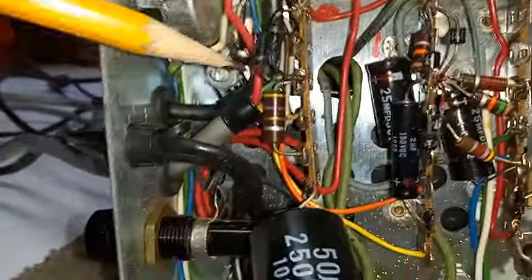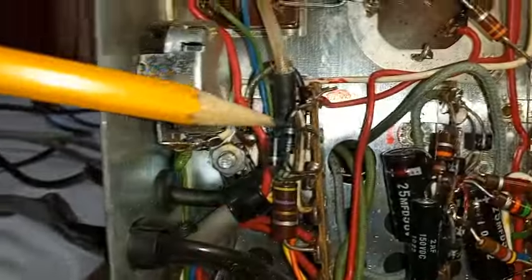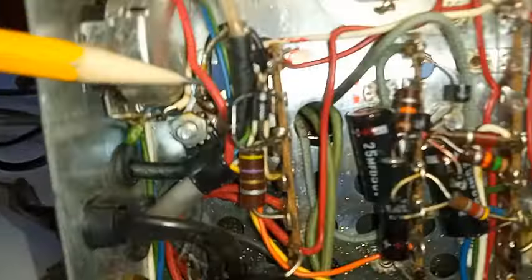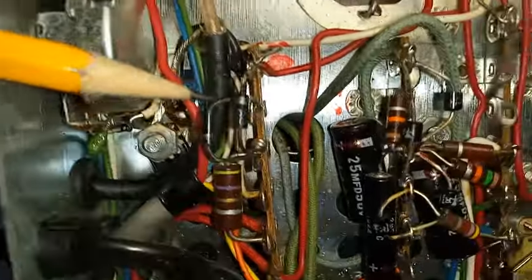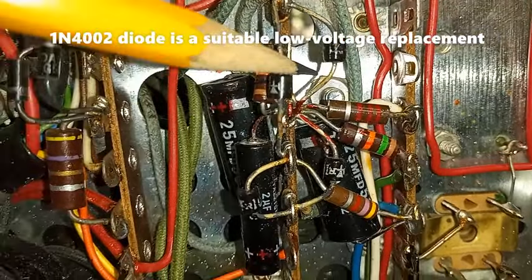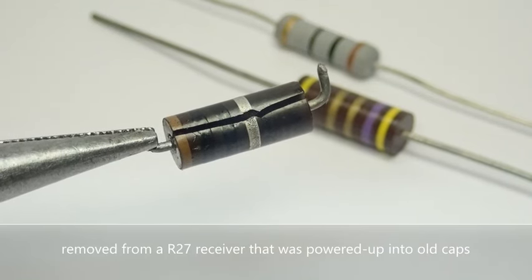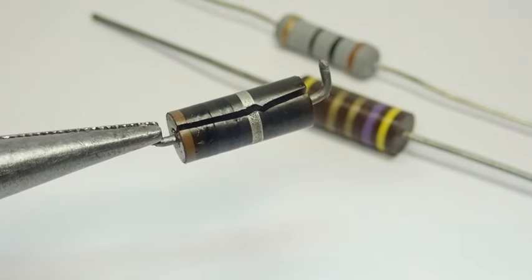In the event that you've had a Browning with a popped fuse because of old capacitors, these rectifier diodes should either be replaced or at bare minimum checked. Some of you will have blown rectifiers — they will be burned, charred past recognition. These are the high voltage rectifiers; there are four of them. Some Brownings used a rectifier bridge encased in epoxy. These are your low voltage rectifiers for the bias supply. Even if your Browning's inrush surge protection resistor doesn't look that bad, I recommend disconnecting one end and doing a resistance check, as these resistors really get a workout and oftentimes don't meet spec.